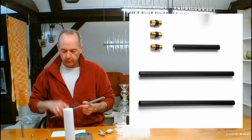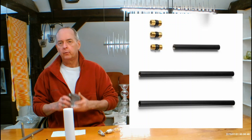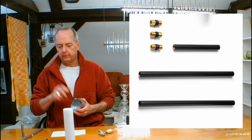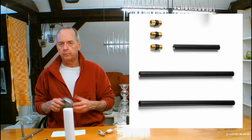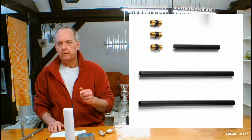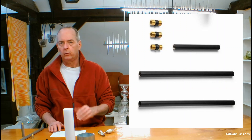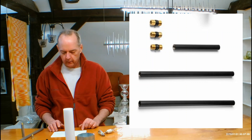The wire is going to exit through a 5.5-inch round canopy on the ceiling, which is going to go over your standard 4-inch junction box. There are some good drawings of that canopy in the installation instructions. This only weighs about 12 pounds, so it's super light — you don't have to worry about any weight restriction at all. It is not slope ceiling adaptable as-is, but if you need it on a slope, we do custom versions with a slope adaptor — email me about that and we can talk in detail.